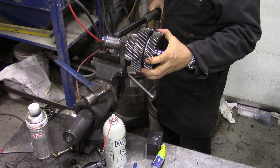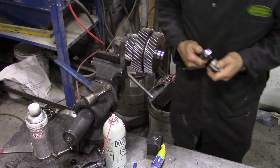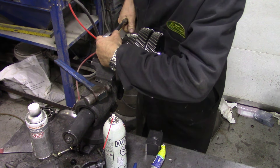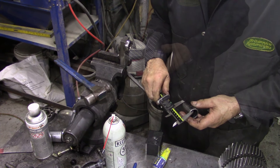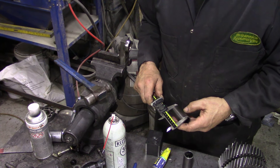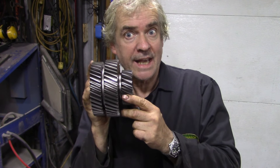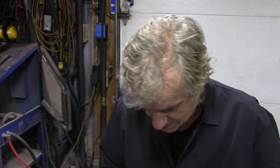I haven't got it tightened up to 80 newton meters and it's already tight - so the short one's out. We'll have to put the longer one and just cut it down a bit. The short one when tight was 58.61mm and this one here is 59 dead on - not much difference at all. What JP will do is put a dial gauge on it, take off all the play, then take about a thousandth of an inch off so you get that nice feel - not too tight but not waffling about.